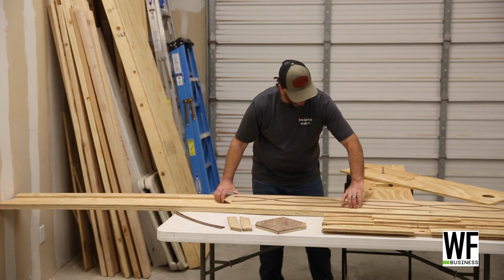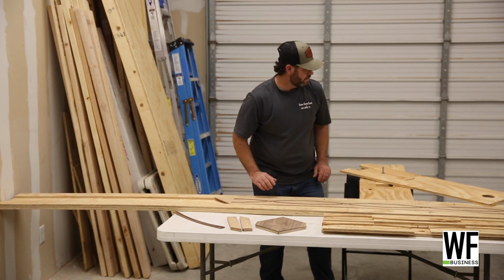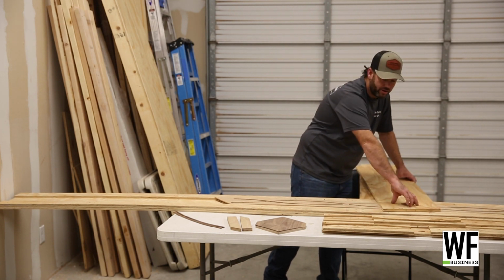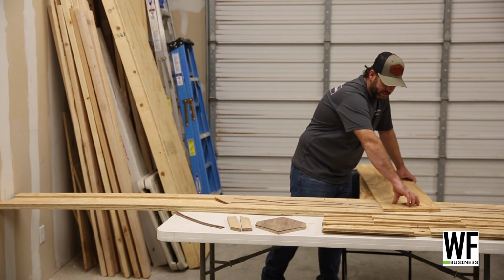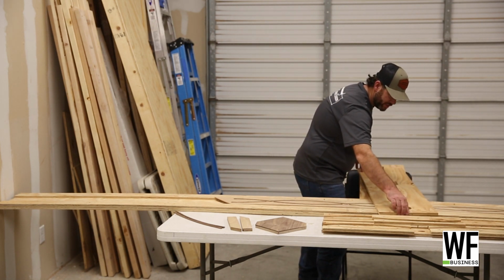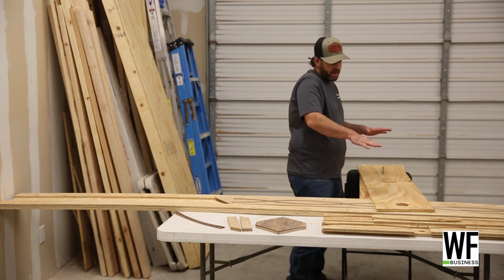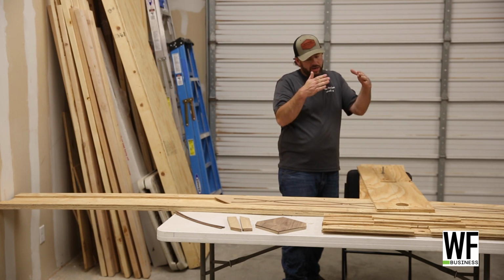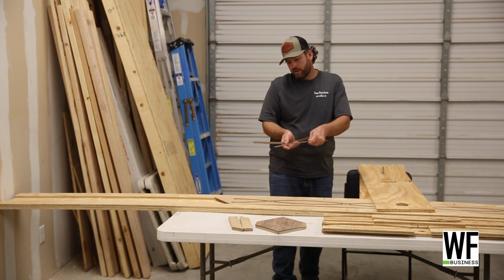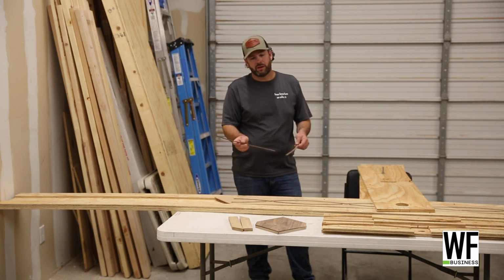So when this is inserted into the cradle, that allows us to use our router jig. We had a router mounted onto this part of the jig, and this is adjustable. So we can adjust it this way, and the pivot point is also adjustable back. That allowed us to get the perfect arc on each increment so that each shape would end on the right points, so that when we hit our corners, all of our corners were identical.